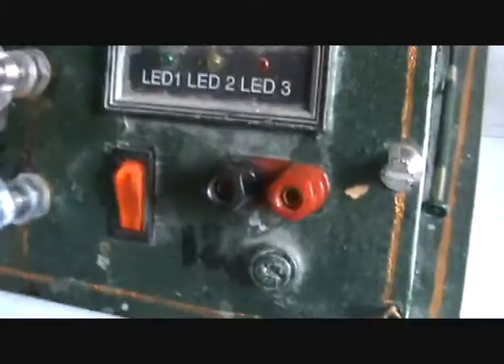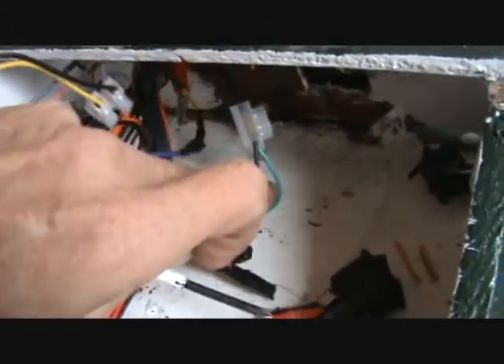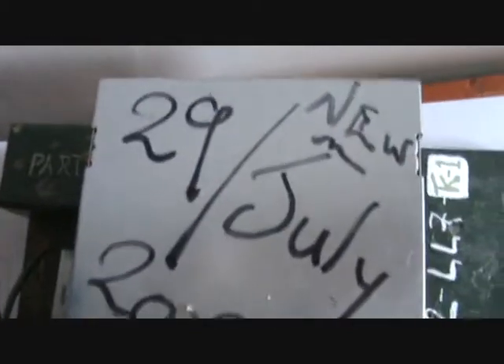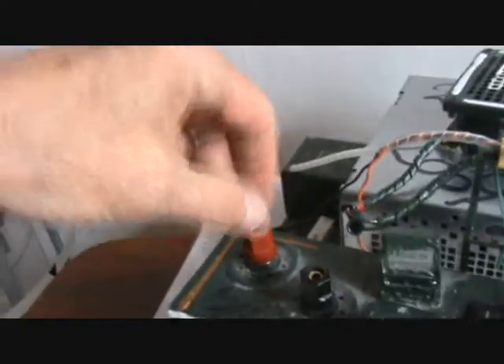You'll probably go through one or two of these. It looks a bit like spaghetti junction with all the wires and stuff, but it's not really that bad. I just use these wee blocks here, and it becomes easier — I've changed twelve of these, maybe this is my thirteenth. This one just went in on the 29th of July and I blew it yesterday; I was drawing fifteen amps and it's rated for ten, so my own fault. You should build one of these wee boxes as well — a base and a cigar box does fine. I found the pins that go in there too shaky and they built up too much heat, so I go straight for bolts.